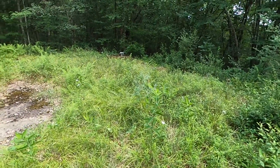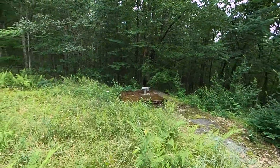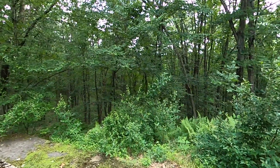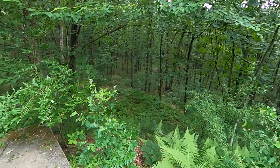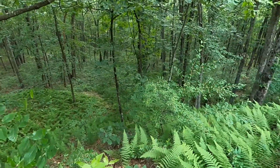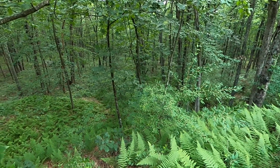Throughout the camp, there's a combination of six-inch water lines, four-inch, three-inch, two-inch, all the way down to one-inch lines. A lot of them are steel — old steel lines. More often right now we're using polypropylene, the black well pipe, for our water lines. Camp is run through a six-inch main water line that runs throughout the entire camp, and you can see how far straight downhill this goes into main camp — this is what feeds that gravity into that line.